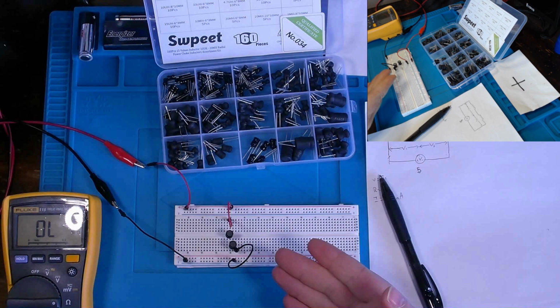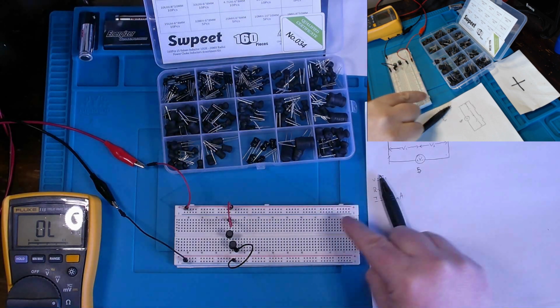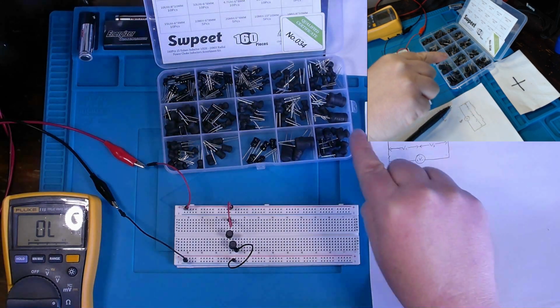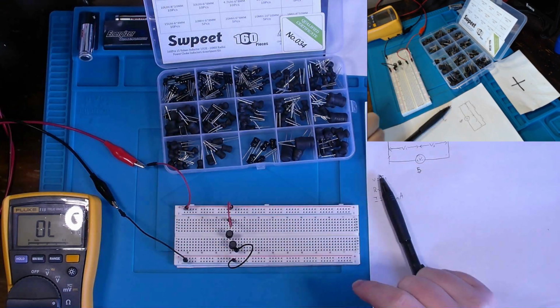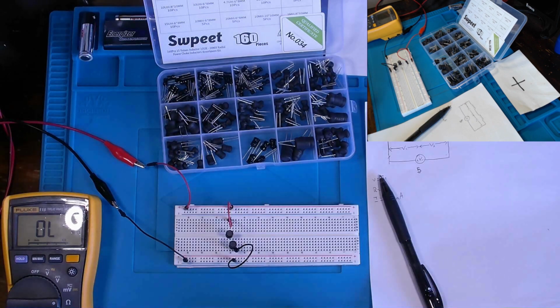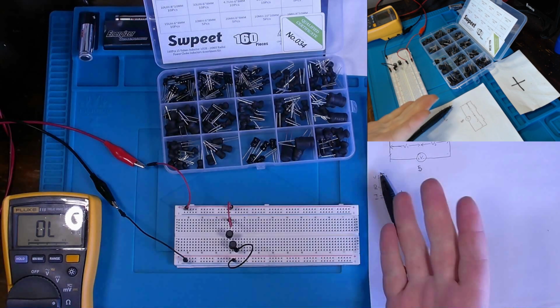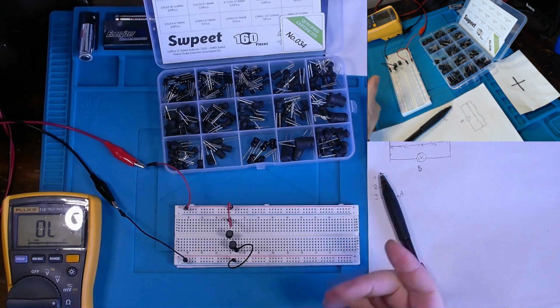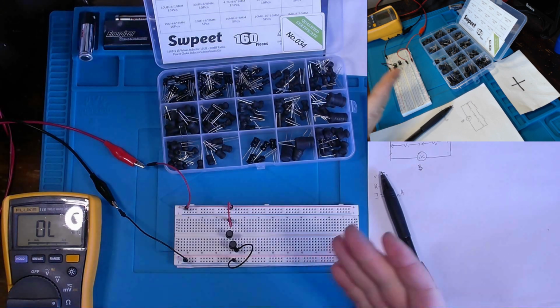And with our inductors in circuit, we have something called the inductance parameter. Now, according to Faraday's law of electromagnetic induction, a change in current, say a sinusoidal waveform versus direct current, which you would have with a DC supply, produces EMF, or electromotive force, of self-induction in a coil of wire, which varies directly with the rate of change of current with respect to time.